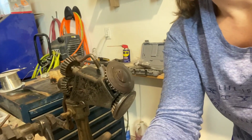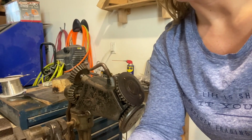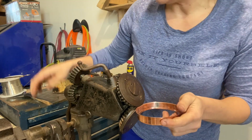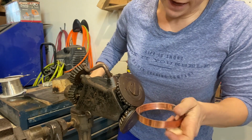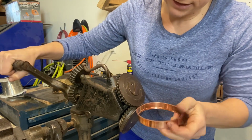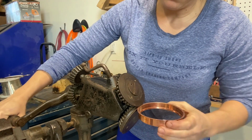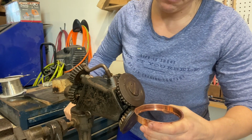follow me, is using the setting down machine. I told you we were going to use like all the tools. So here's a setting down machine. And all I'm doing is I'm making this burr sit nice and flat. Oops, I ran off. And 90 degrees. So you're holding this at 90 degrees against this face here. And that's just gonna make, again, setting down that crimp seam really, my gears are really tight. Really nice and easy for you.